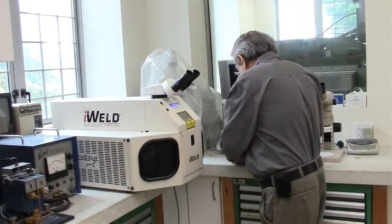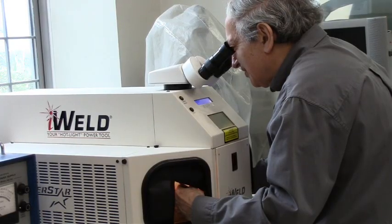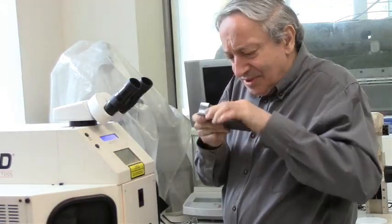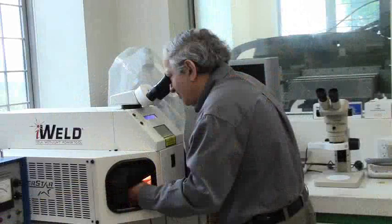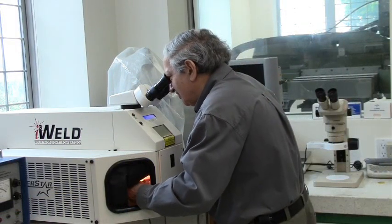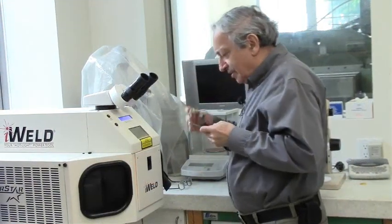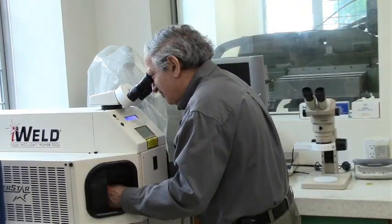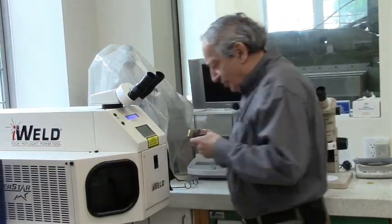So let's just tack things in place. That's welded — it's also a bit crooked, but these are temporary welds; I can break them if I want to. I want a brass boss at this place. That's the beauty of the laser welder: it doesn't care what the metal is. I can weld aluminum to steel, silver to lead — anything to anything.